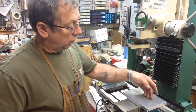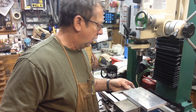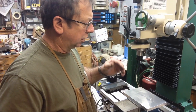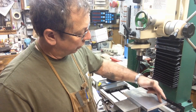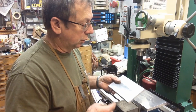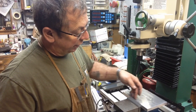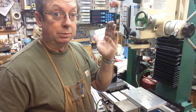The mill itself is telling me a couple of things. The finish is not as nice as I've gotten with this cutter before — the cut ends up being not quite three inches, probably two and three quarters. I've got a ridge here and a ridge here, and it's enough of a ridge that I can feel it. What that's telling me is that the mill is out of tram — we're leaning this way a little bit as opposed to being vertical.